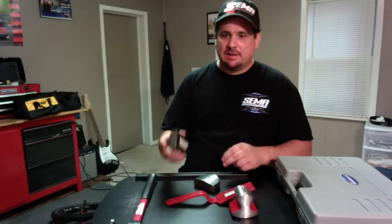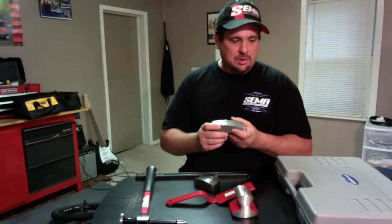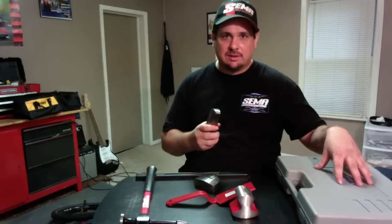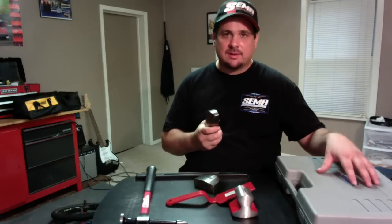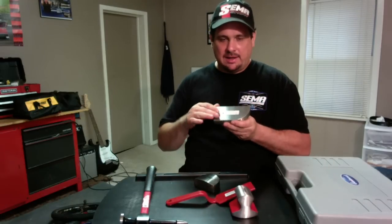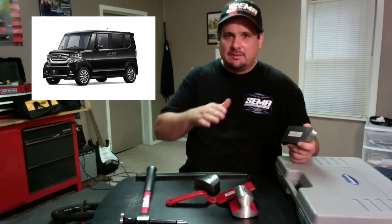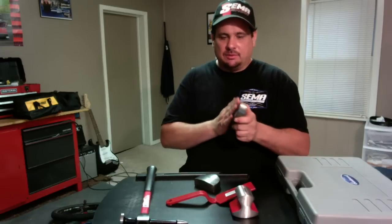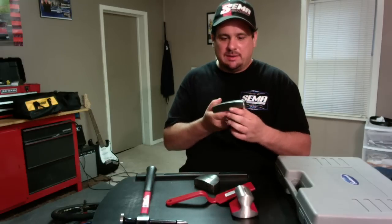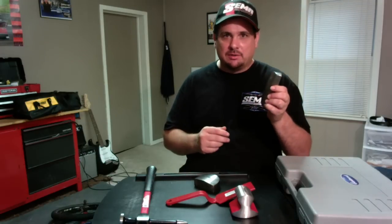Every dolly has a shape to it. We'll talk about hammers as well. I'll put a link down in the description to these dollies so if you want more information about those or prices, you should be able to view what the current prices are. Dollies have a lot of different shapes. You'll notice that this one is flat — really flat here. However, we don't drive too many boxcars. Usually a panel has somewhat of a contour in it, and so these flat surfaces may not come in too handy, though there are times when they will. So that's why these dollies have all these different shapes.